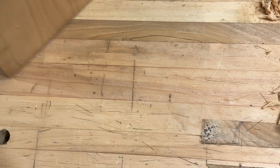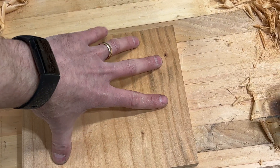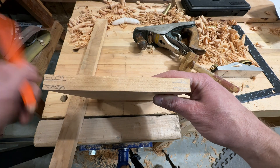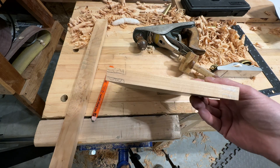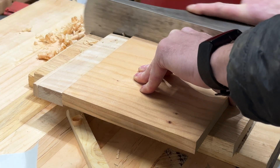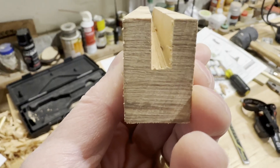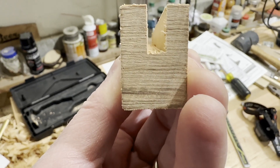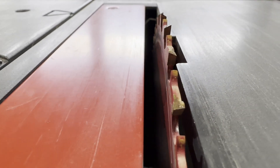Just check to see here if it moves back and forth, if I feel a little wobble in it. To prevent the base from warping, I decided to add some breadboard ends. Every board will warp — plywood resists it, but this is natural wood and it's going to either cup one way or the other over time. So I decided I would do what I could to stabilize it.